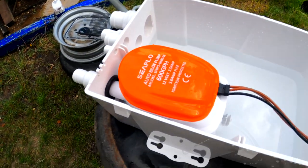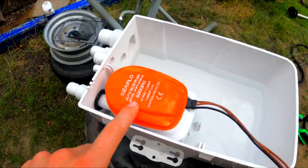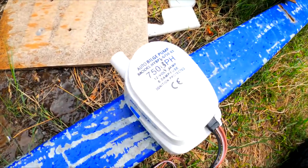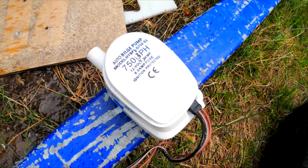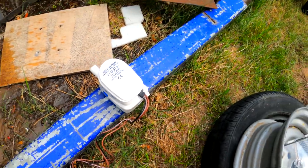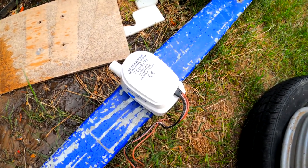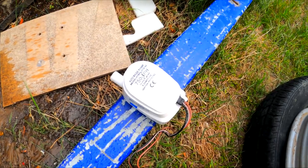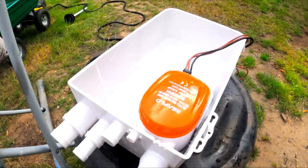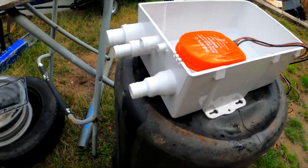Testing complete. I'm going to leave the 600 gallon per hour in the sump box because it seems to be plenty. I'll use the 750 gallon per hour Chinese unit as the actual bilge pump for the boat, since it'll be able to pump all the water faster and it's got a little longer distance to travel, being mounted further down under the floor. This should do the trick.